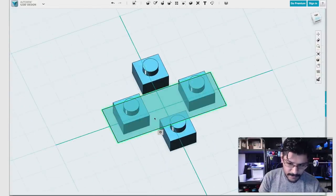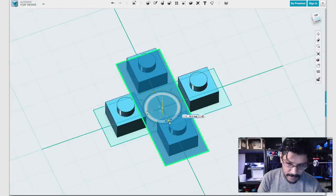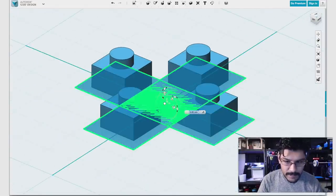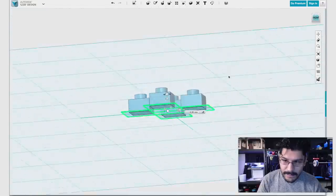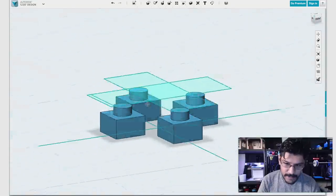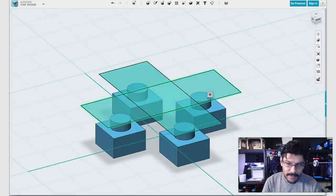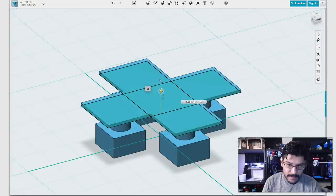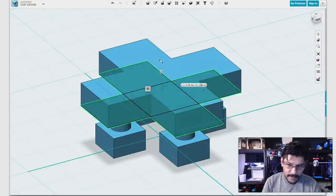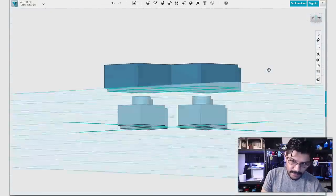And now that that's created, I need to create another one on the Y. So I'll just copy that sketch and paste it, and I get my little transform handle, and I'll just rotate it by 90 degrees. And now I have those two. The next thing I'll do is I'll move it up just so that it's away from the shapes. When you're extruding sketches, it tends to cut them or merge to them. So I'm just getting it out of the way. Now I'll go ahead and select these two by holding down shift, and they're both selected, and I can extrude them at the same time. So I want to extrude them at 4, add 4 for the distance, that's the thickness, and make sure it's a new solid, okay? And now I have our kind of D-pad looking plus shape. So that's one easy way to do that.